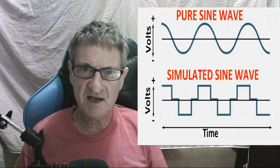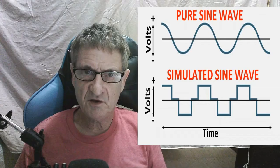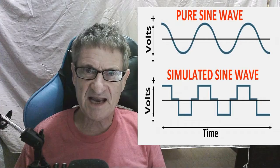A lot of times they might not even know what you're talking about, but believe me, if it's a pure sine wave, it will say so on the UPS. It will be proud of the fact that it's a pure sine wave, and you'll be sure to see it. If you don't see anything, that means it's a modified sine wave. You'll probably see a little print somewhere on the box, or maybe in the user's manual, that says it's a modified sine wave. I have a funny story about that, which I'll share.